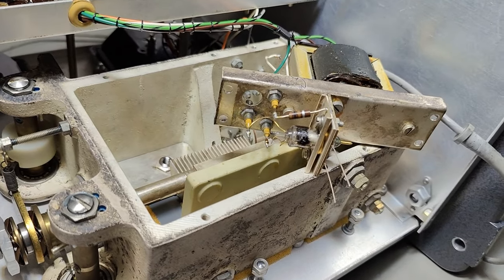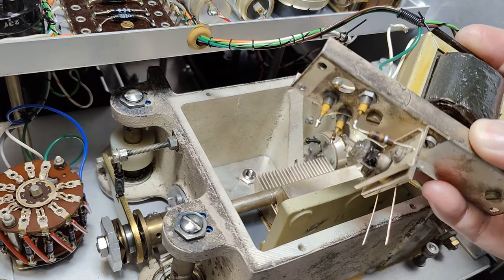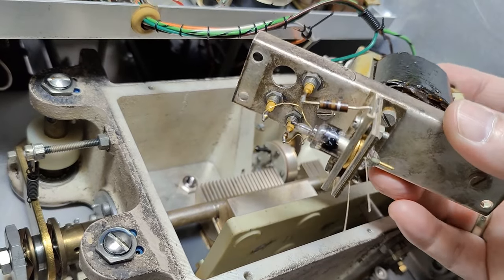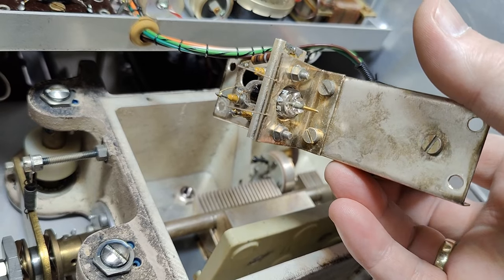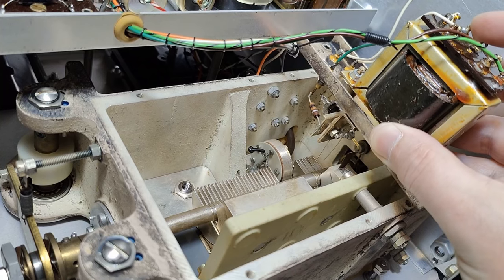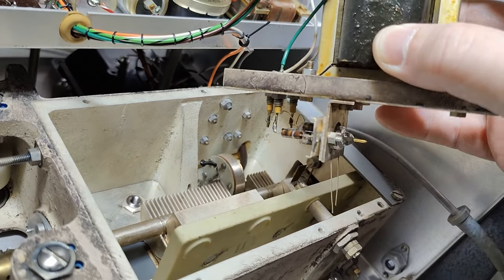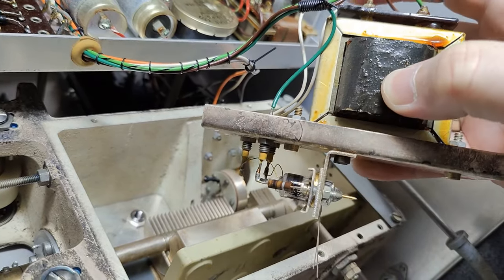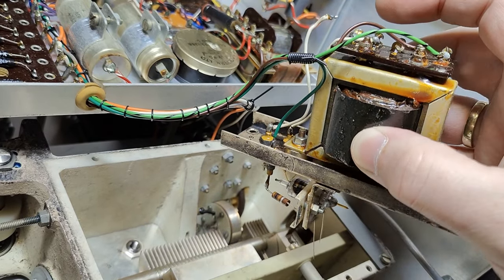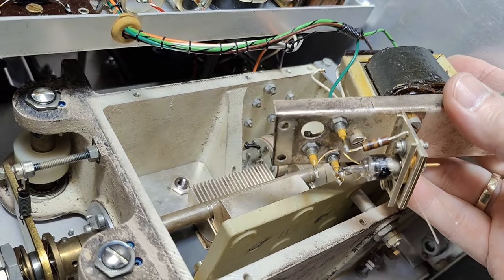Let's look in here — I'm trying to figure out exactly why this is not working. I thought it was this diode. This is the pickup diode V4, the EA-52. It's a very nice and special diode. We've got some thin wires here connecting down here. The tip of the diode goes down here, and this is the transformer for the filament — this diode has an individual filament. I lifted one of the filament wires just to verify we have a realistic resistance in the filament, so it's not completely open. I'll try and see what I can do.